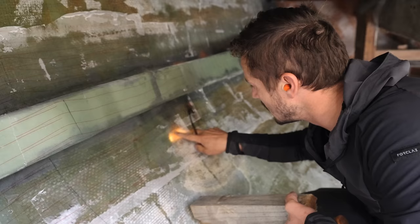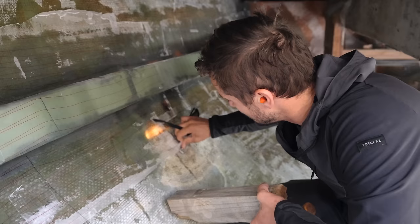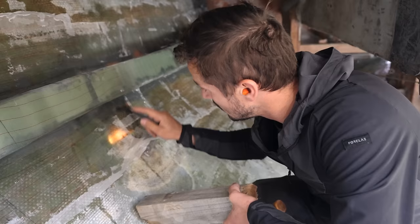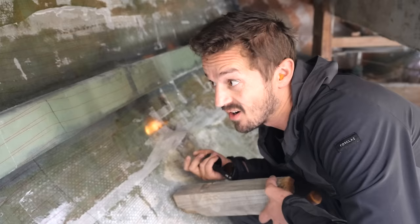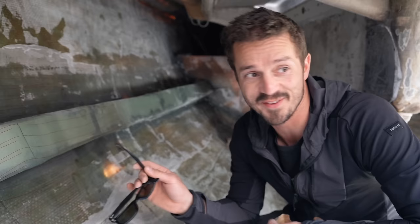This light section coming through here and this gray area — this is where the old scupper drain came out. I was hitting right here and up into the rib, and I can't see any signs of delamination at all. This lighter section is just the peel ply. It would have looked more white if we could have gotten it to delaminate. I was hitting it hard too. We're feeling much better about this whole thing. But it does mean we need to experiment more and figure out what went wrong with our test piece, because starting next week we're going to be laminating bulkheads in. We want to make sure we do it right.